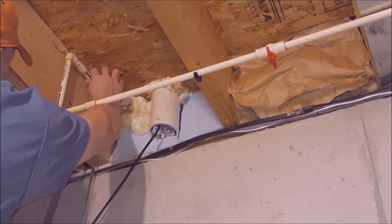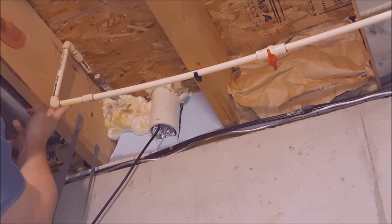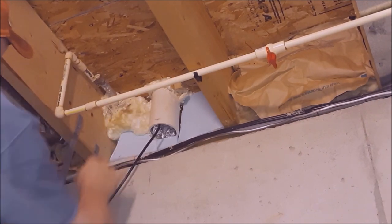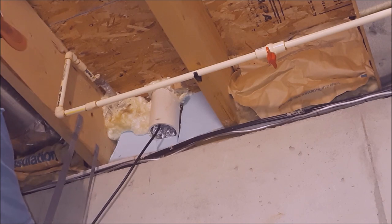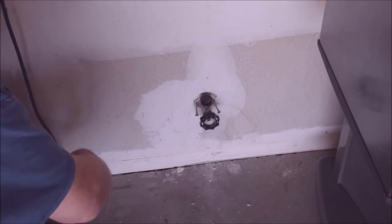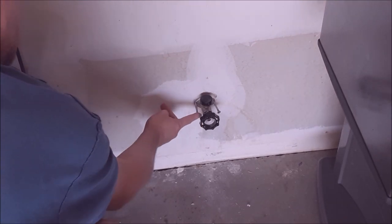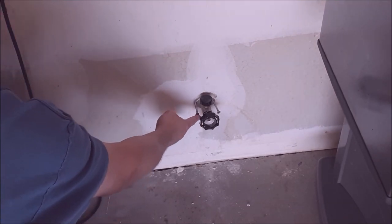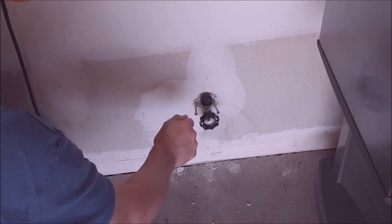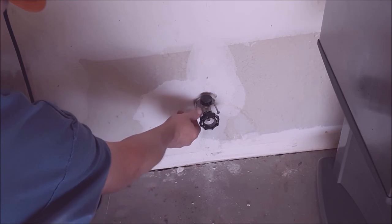Since it's leaking, it's obviously going to drain off by itself. Then we'll go ahead and cut it — I've done that right here. You can use a Sawzall, hacksaw, or they even make PVC cutters. You're going to take the screws out in the garage area and we'll go do that now. It's disconnected. I've got the screws almost all the way out — they're just regular Phillips screws that you'll take out with a cordless screwdriver or a hand screwdriver.